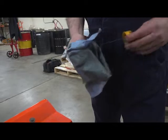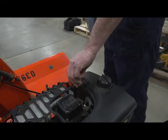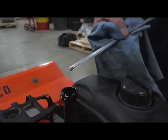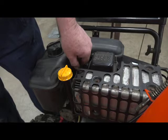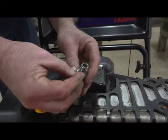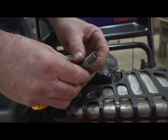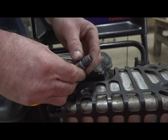Working our way up, we're going to check the oil level. Wipe the dipstick off since the machine was flipped over, and you can see it's right up at the full mark. We'll also have a quick look at the spark plug — this plug is in pretty good shape. You'll find deposits around the center cone and inside; if the machine is running correctly it'll be a dark brown color, maybe with a little bit of black.